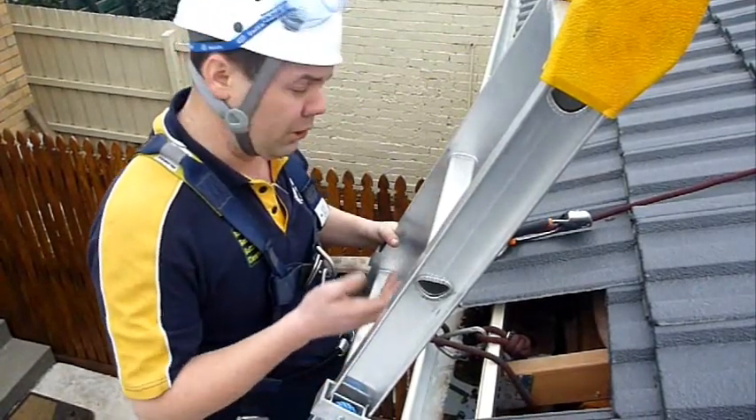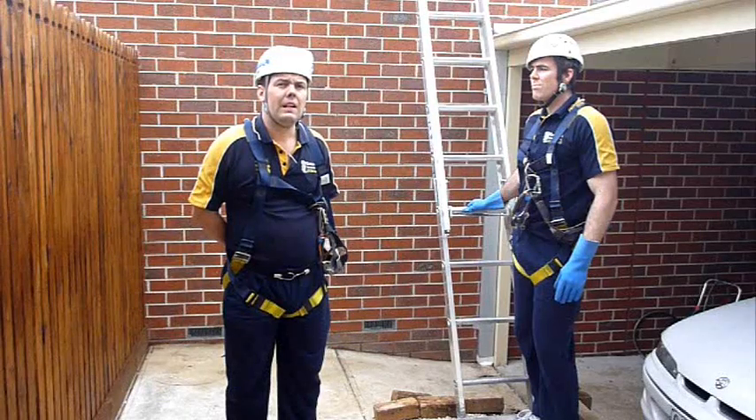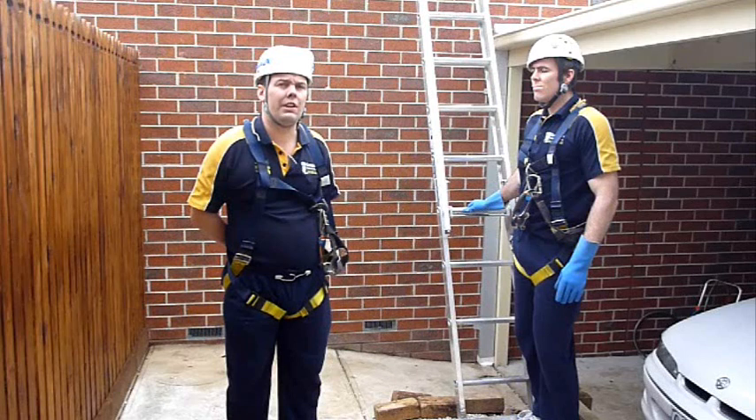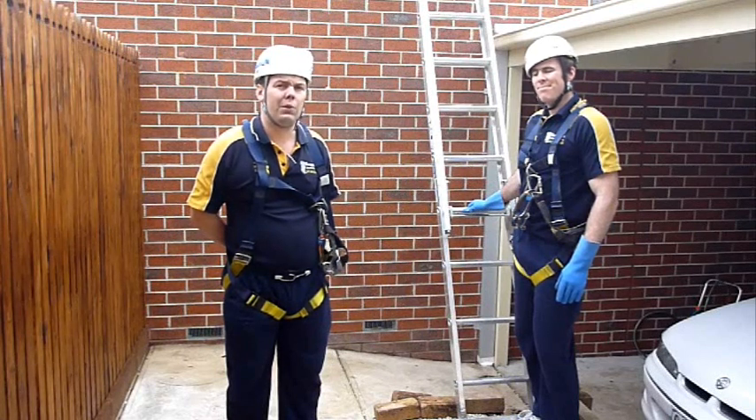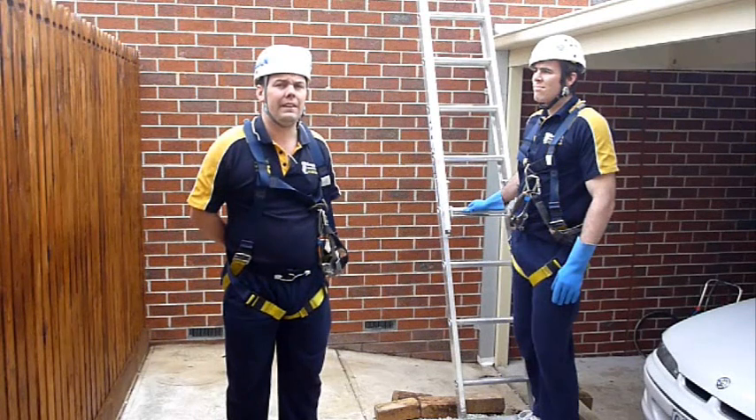This will only work if you can actually move the roof tiles. For accessing, the ladder should reach at least 90cm above the roof edge so you don't have to step on the second rung from the top as you climb onto the roof. You should never stand on a ladder rung that is less than 90cm, or less than 36 inches, from the top of an extension ladder. By standing too close to the top of a ladder you end up with nothing to hang onto, which can cause you to lose your balance and fall.